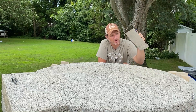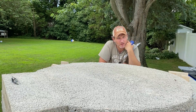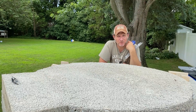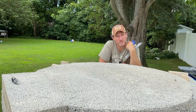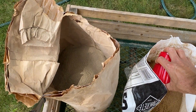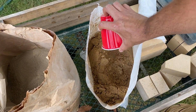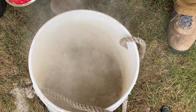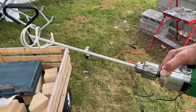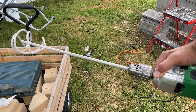I'm going to let it dry for a little bit, then we're going to use a notched trowel and create some notches in here, kind of like when you set tile for a bathroom floor. What it's going to do is allow us to press down on the bricks if we need to, to get them level with the others. The mixture is a one-to-one ratio of fire clay and masonry sand. You're going to add just enough water to get a paste-like consistency, so that when you use your notched trowel, those edges stay firm. You should really think about getting one of these mixing paddles — this one is for joint compound, but it works a lot better on materials like this, thinset, and things like that.